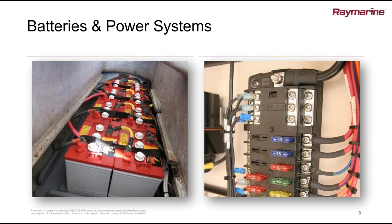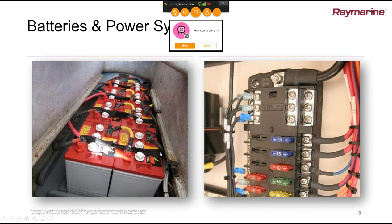That's really the foundation. Batteries should be properly secured down in place — make sure any battery restraining straps haven't deteriorated over winter and that all contacts are nice and clean. Moving on to your fuse panel: fuses can look fine but over the winter condensation can get in and you can get a bit of verdigris building up, putting a high resistance connection across that fuse. As soon as you turn the electronics on, they draw current, voltage drops, and you get equipment just power cycling constantly and not being able to boot up properly.